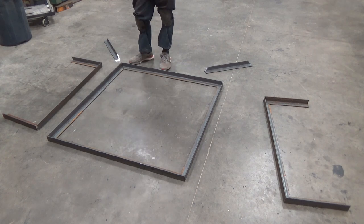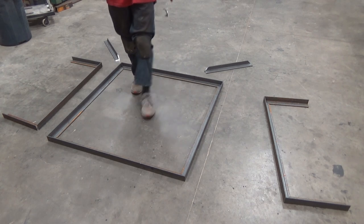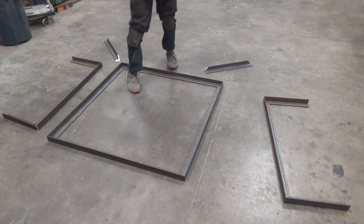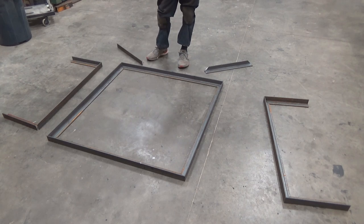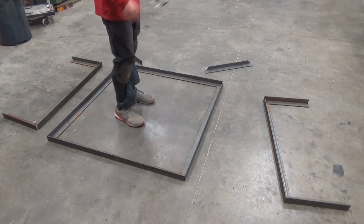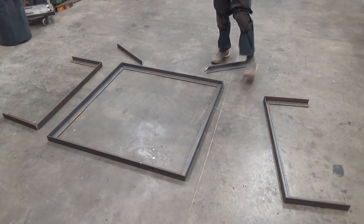And then each side are the two risers for the gantry rails. They're kind of backwards, but they'll look nice and they'll sit on the back of each, because of course the spindle actually sticks off, center off 6 inches off the gantry. So that's why those are 42 long and it's 48. So there's that stick out, so the work will be in front. That'll be kind of a blank space in the back, which is whatever. And then I'll cut some gusset arms that'll go on the back for those guys and keep rigid. The front I'll probably do something in the future. And the ones I haven't cut, I'm hoping to do two pieces this way. And that's just more mounting and rigidity for the actual waste board and the table and such.